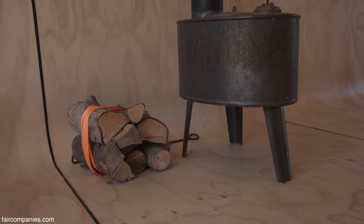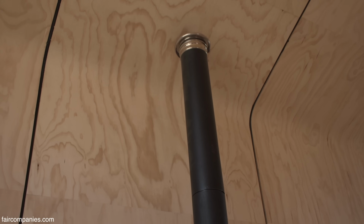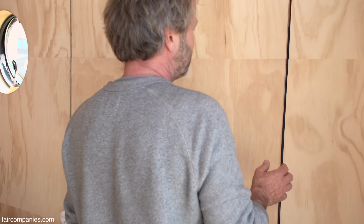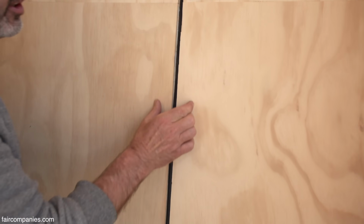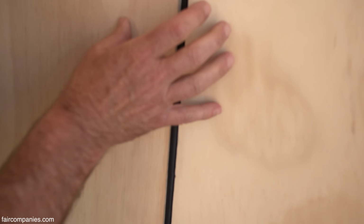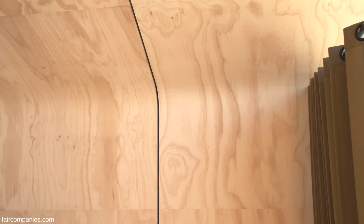So in the end, you don't see any cardboard? No, unless you drill a hole. Yeah, you should be careful with that. Don't drill too much in the cardboard, because if you want to hang something, there's a very strong section here, because this is 36 mil of plywood, 30 behind it. So here heavy loads could be hung. And then of course you can drill a hole here. It's not the end of the world, but it will look ugly.